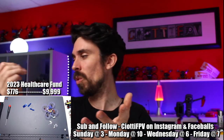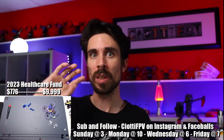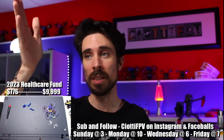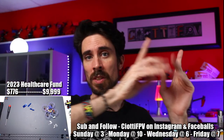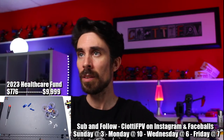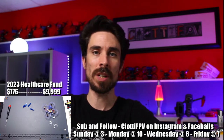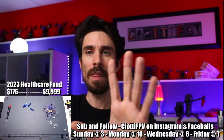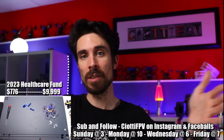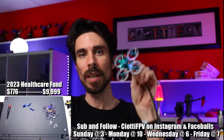And what it is going to do is when I put these 29,000 kV motors on here, they're really going to wind up with the bi-blades. And it's going to make sure that these dynamic notches can move high enough to cover those higher frequencies. So, yeah, don't think that I'm adding a bunch of filter delay by moving that max frequency up to 1,000. I'm just making absolutely sure that it has enough range to cover the really high RPM that Tiny Whoops turn.